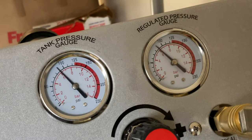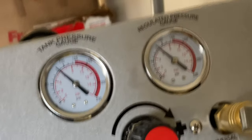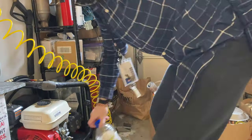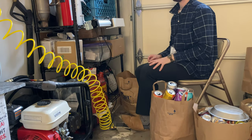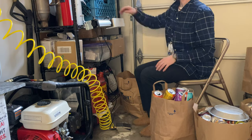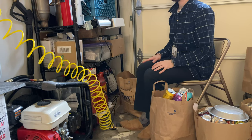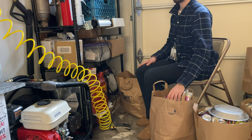If it charges all the way to full pressure, I can get about 2 cans per cycle before it turns back on. Rather than waiting for full cycles, I just throttled it the whole time and kept going — every time I got to about 100-110 PSI, I'd fire the unit. You can do about 6-10 cans per minute using this compressor with this device.